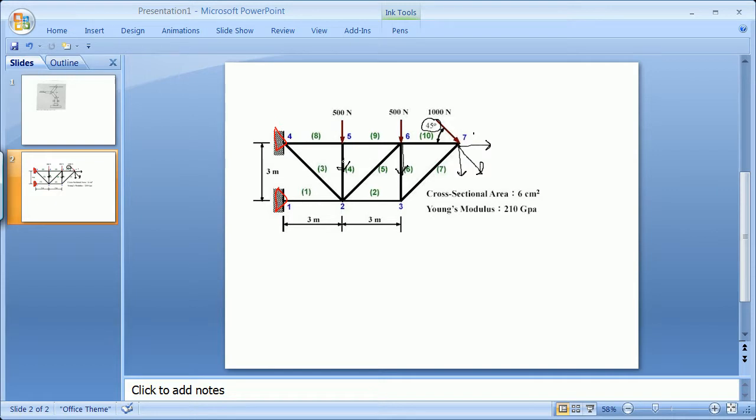All right, that said, first thing, the question of how to use method of sections is really straightforward. Once you solve for all the reactions, even though you don't need to, you can cut any three members, because you know the direction of force within those members is tension or compression. You know they have no shear, and no bending, and so it makes it pretty straightforward. And so we will do that here through these, and we cut those three.